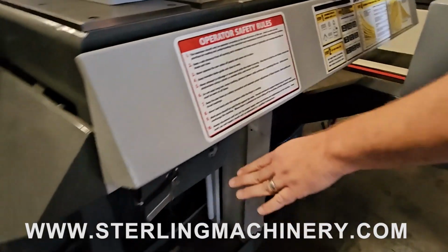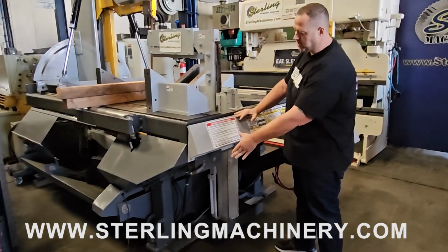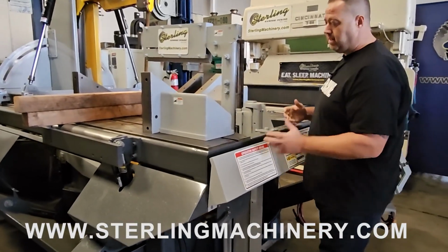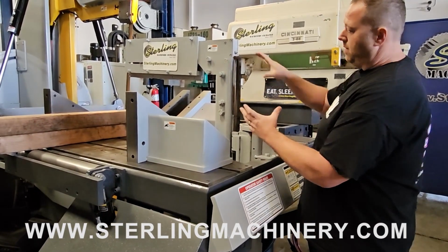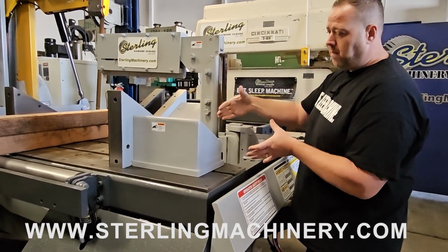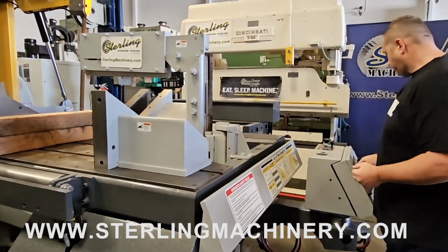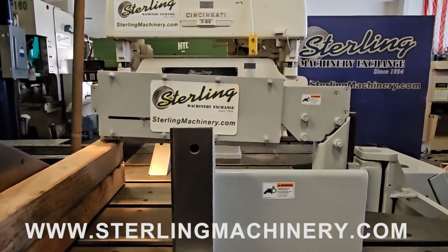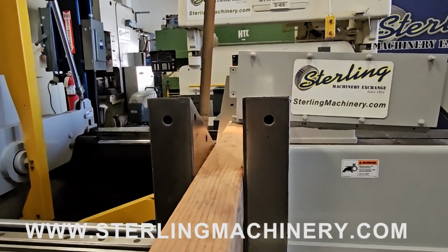Right down here is where you're going to have your hydraulic on and off. So once you actually clamp down on everything, you're going to want to turn that down so it's not going to continue clamping down on everything and crushing it. There's a certain spot where you'll have that depending on the materials you're going to be cutting. Now, the idea of it is if you have a big round bundle or a big square bundle of 20 different pipes, 10 different pipes, when it squeezes down, not only is it going to squeeze vertically, but it squeezes horizontally, as you can see. And that would be the set point right now.